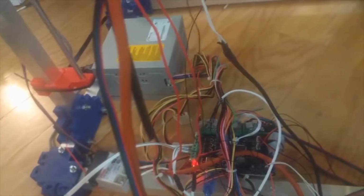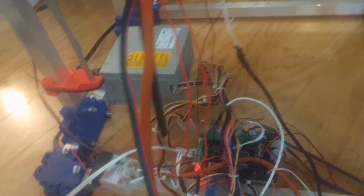I created a modified version of the Marlin firmware, and I had a plan in place as to how to complete the project. The real issue is that the Z-axis is by far the hardest axis due to the mechanical complications of moving a heavy bed, and I was just never able to get a reliable Z-axis working, and at this point I would have had to put in a lot more money to buy better lead screws, better rods or linear bearings of some sort. And I probably would have had to do some metal fabrication for a mounting device. So at this point, that isn't happening.